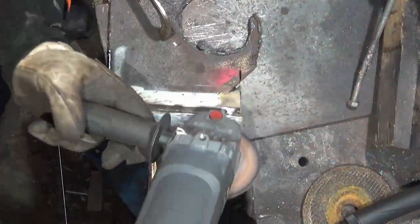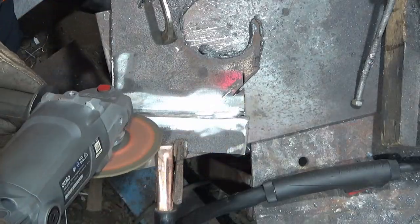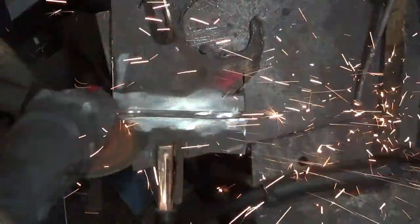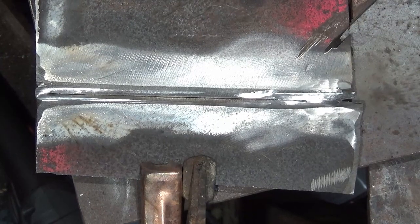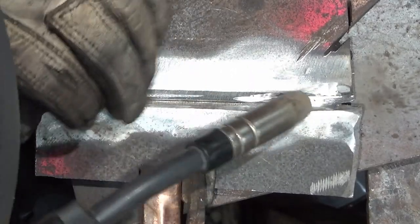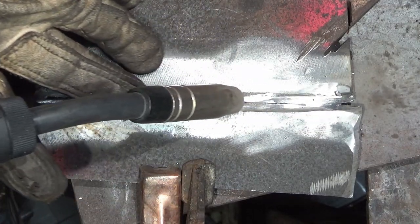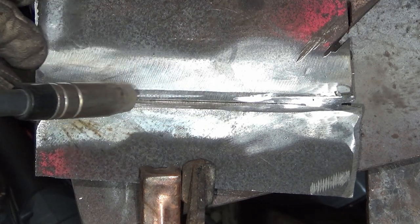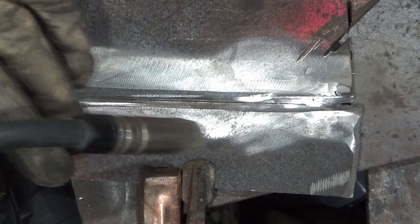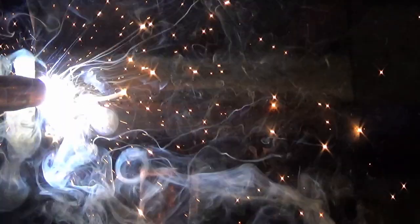When you go to start welding, get your head in there — stick it up nice and close. Not close enough to set yourself on fire, but close enough so you can see exactly what's going on and you've got good control over your MIG gun. Put one good solid tack on the top, one on the bottom, then hit it with the grinder and grind it all down again so the valley is empty. In most of my welds, I prefer to drag the MIG gun towards me rather than pushing it away, because it keeps the welding valley clean from soot, smoke, and bits of spray metal.